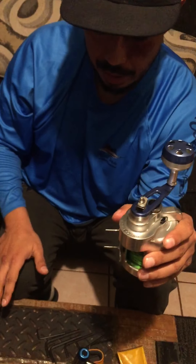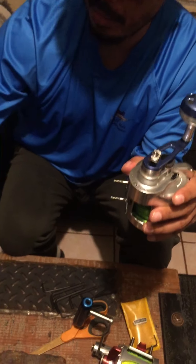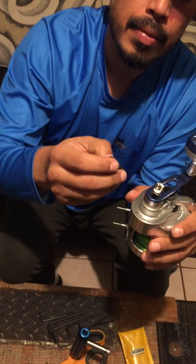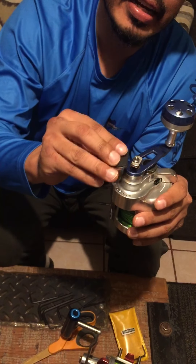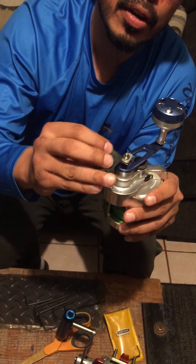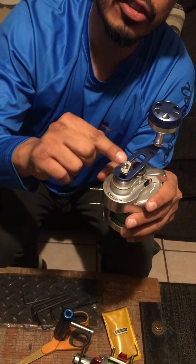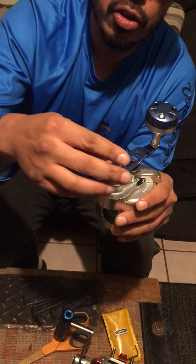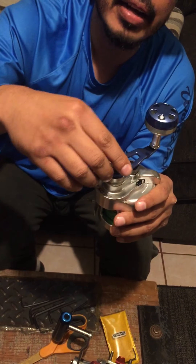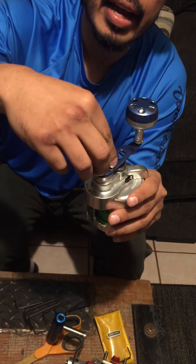What you can do is get yourself a metal file, or I've got some sandpaper that's for metal and I'll go ahead and sand it. I already sanded this one down — I sanded the burr and I go to feel for it and it's no longer there. Be careful not to scratch your handle. After that, set this back down and spin it and now it doesn't get caught.